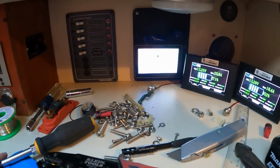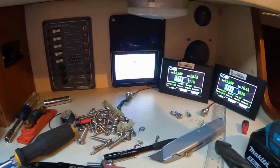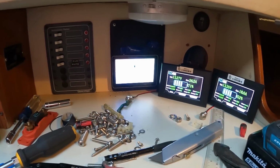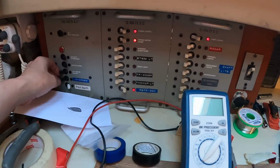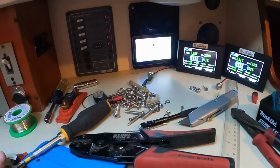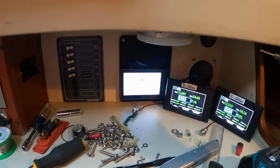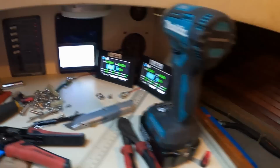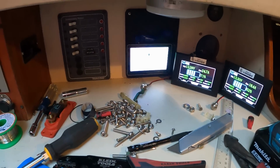We're pulling only 891 watts from the grid. That seems kind of low. That's not even 10 amps. Why is it pulling so little? Still have AC. Don't want to turn on the hot water just yet. Now I'm pulling 1,000. Actually, let's turn on the hot water heater. Now we're pulling 1,700 from the grid. So why is the charge limited? Yeah, we're pulling 2 kilowatts now.